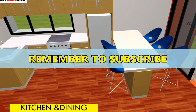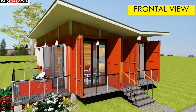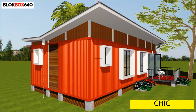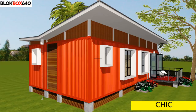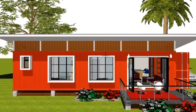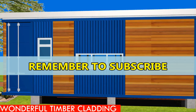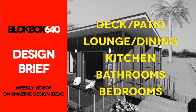All the end panel doors are fitted with full-height sliding glass doors. Sliding and folding doors are good space savers and ideal to use in a container house. The balconies are fitted with a glass balustrade to create that feel of lightness. When using a one-way container as a sustainable design statement, we suggest leaving the exterior of the shipping container as is, including its original color and markings, to preserve its charm and reduce costs on painting. Depending on location, budget, climate, and local planning regulations, explore other exterior finishes such as stucco, timber cladding, or cement board.